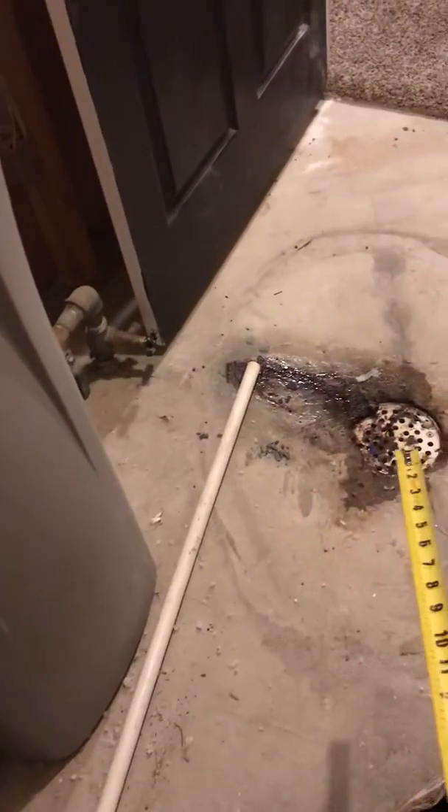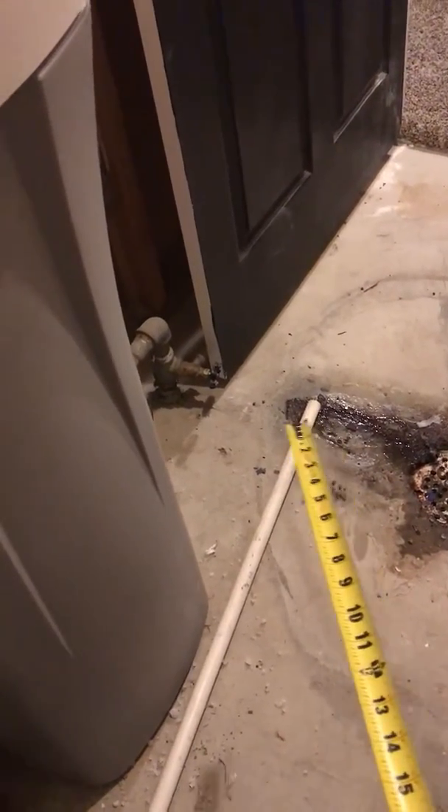Condensation for the coil and for the furnace — we'll run them into one pipe going out and actually have it drain into the floor drain, not six inches to the left of it, so it's not leaking all over their floor.